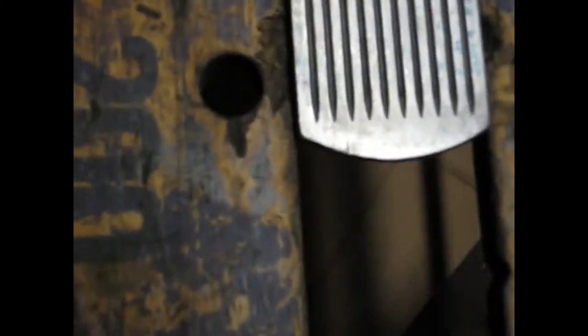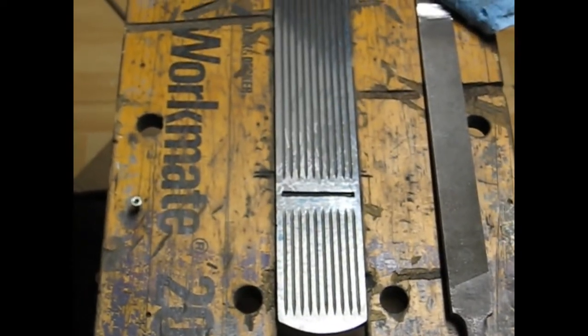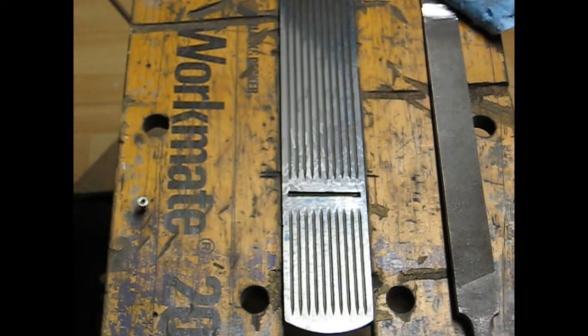Here we are after about 4 hours of scraping — looking really good. Great contact on the front, pretty much all the way to the mouth, which is awesome. Making contact along this edge all the way to the back, and in the back a couple inches we've got fantastic coverage. However, there is a hollow right down the middle of the plate that we still need to bring out. I'm going to call this the end of sole flattening video 1 — thank you for watching. I'll do a second video covering the latter half of this process, and I'll post both on the same day since I've been way behind on posting.